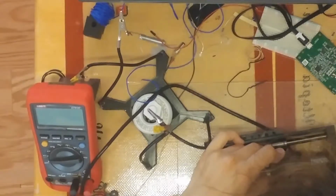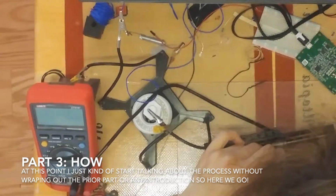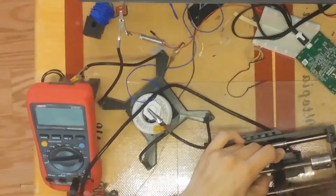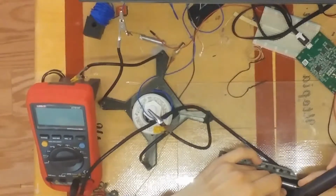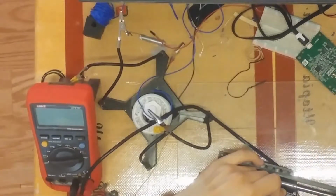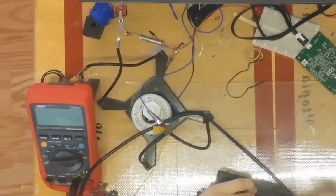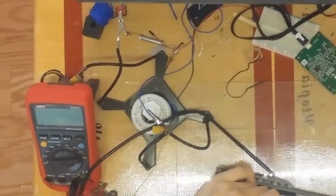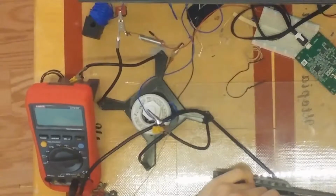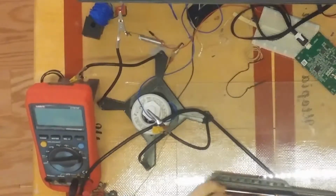However, first I had to mount the laser diode to the chocolate extruder assembly, which was actually fairly straightforward. I used 2 3D printed L brackets and M3 screws mounted into the back of the laser, and then welded on to the 3D printed plastic of the chocolate extruder using a 3Doodler pen. Pens like this come in very handy when you want to join plastic parts. They make a very strong bond, even without extruding any other plastic. And if you want to fill gaps, you can extrude extra plastic through them, as I did here. After I had started combining these two parts, the next step was to begin stripping down the 3D printer.